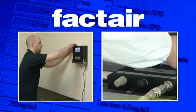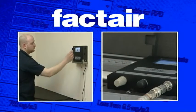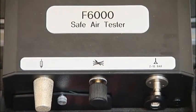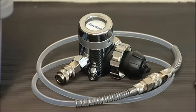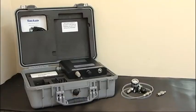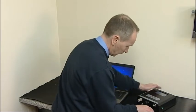Safe Air Testers are designed to provide a quick and easy method for carrying out accurate periodic testing of breathing air supplies. This training session features the F6000, which is designed primarily for use on airline systems up to 10 bar, but can also test high-pressure charging systems when used in conjunction with the F3002 High Pressure Regulator. The F6000 has a coloured touchscreen display and is supplied in a hard, weatherproof case with storage provision for accessories. It's primarily designed to be used from within the case, however the tester can also be removed and operated separately where space is at a premium.